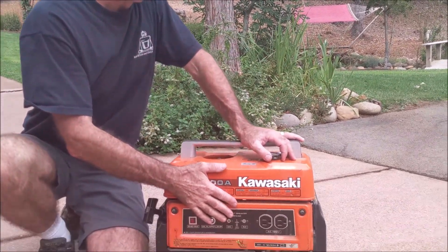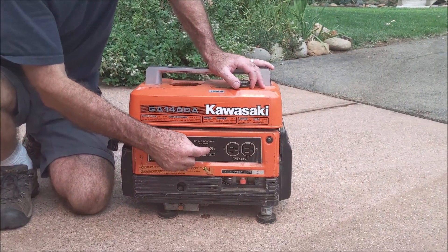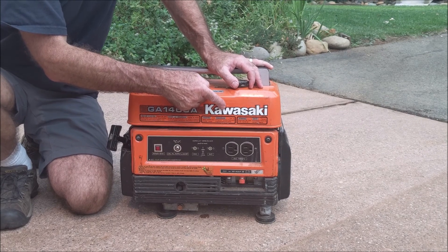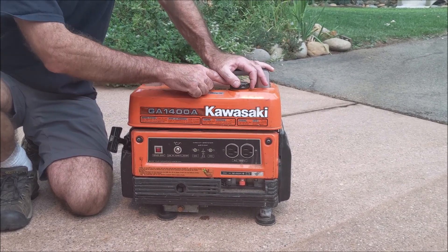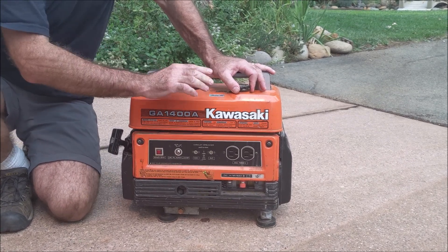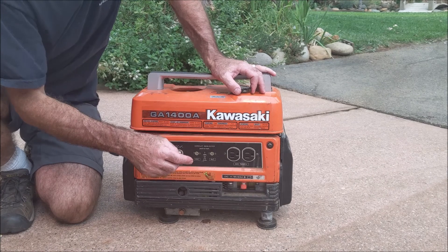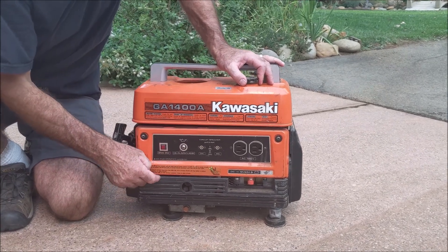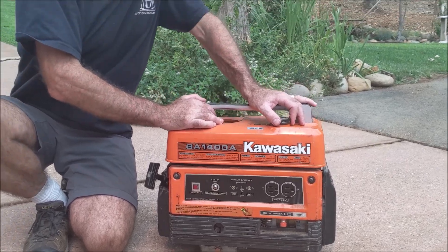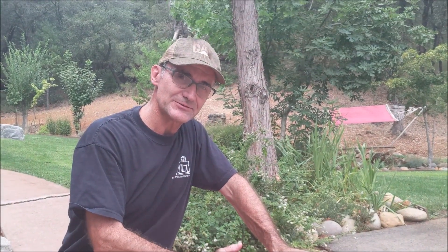So I hope we learned a little bit about generators. A couple of key safety things: always outside — I know I've said that a lot. There are breakers built in; these little things will pop out if you've overloaded too much electricity on it. If you use old gas, it will not work — it needs to be fresh gas in a gas can. It's four-stroke, so no mix. There's a kill switch, and that's about it on these generators. If you're new to this channel, think about hitting subscribe, and thanks for watching — any comments below would be appreciated.